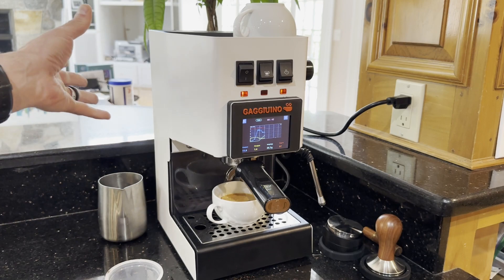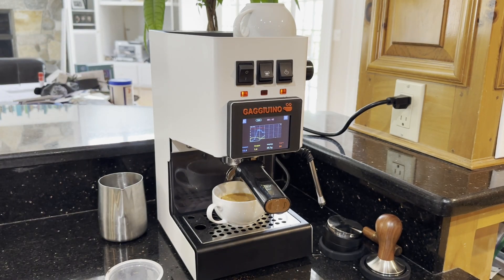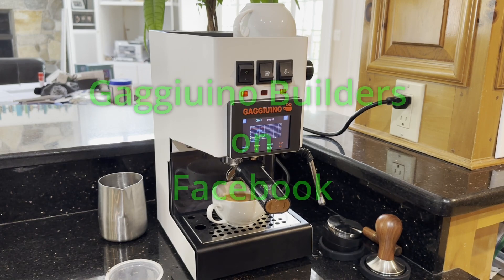I think this looks really great and it's the cleanest way to do a build. I'm really happy with it. I love the fact that I used a new machine with the painted color, and I definitely enjoyed the process — I would highly recommend building one. But you have to know about electronics because you have to make decisions along the way. The documentation is really good, but they support four different machines, and not everyone who works on it owns each machine, so it's not like there's one perfectly clear set of instructions for each machine. There are excellent schematics — what I did was print out the schematics and check off each connection as I did it. And even then, I made some mistakes and had to go back and fix them. You're also working with line voltage, which is potentially lethal, so you really need some electrical experience. Remember to unplug it when you're working on it. If you have any more questions, please go to the Facebook group link and we can answer them there. Thank you.